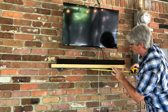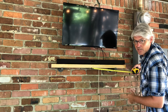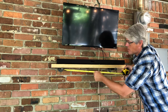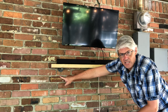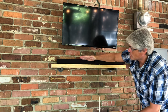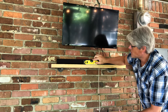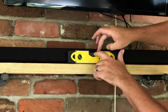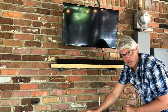Then you find the midpoint between the center of the TV or whatever you're centering this against. Take a measurement out to the other side and use your wax pencil to give yourself a mark. Put your piece of wood back up and use a level to set it, then move the flange to a place where the shelf is level. Take it off, mount your bracket, and you're good to go.